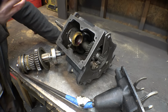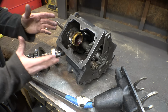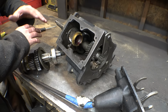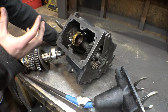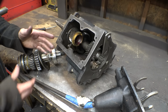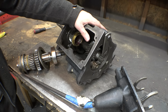So we're gonna be using this in pretty much the exact same setup as the CBR1000. For those who don't remember or haven't seen that project, we're using this as a secondary transmission for this project. This gives us high range, medium range, and low range, and reverse. These things are way cheaper than those reverse gearboxes. I've looked up in the past trying to find an easy way to add reverse to motorcycle engines, and you can find these reverse gearboxes, but those are like $3,000 or $4,000 if you can find them on eBay, and they only give you reverse. This was only $900 for a fully rebuilt T90 transmission, and this gives us low range and medium range. So I'd say this is a lot better, especially for this project where we got giant tires, we got four-wheel drive, we're really gonna need low range, and this gives us low range.